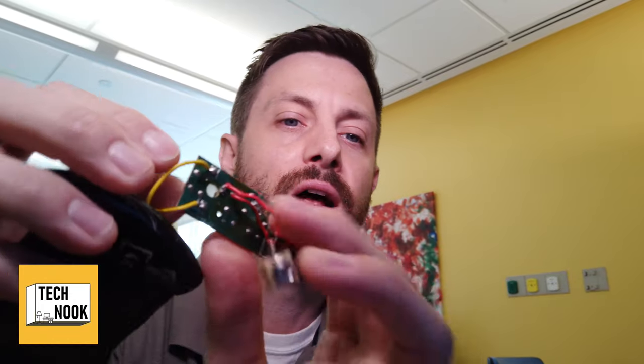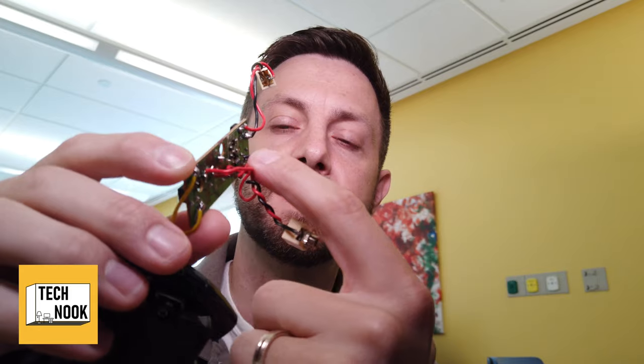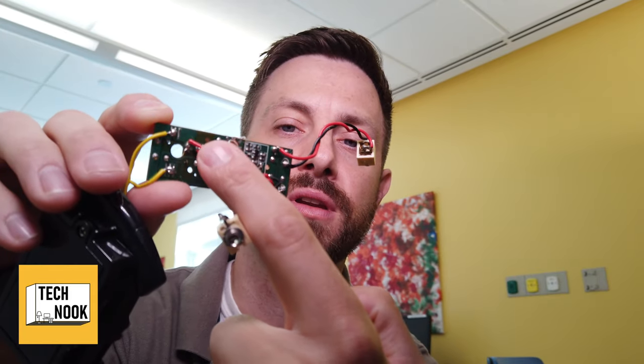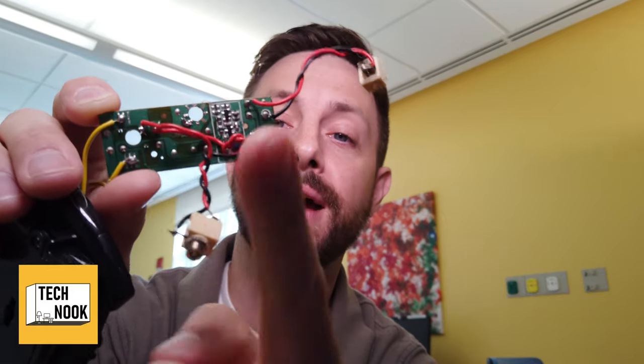So I found the one for the turn. I've connected one side of the back to one side of the turn. And then the headphone jack, one side goes to the other end of back and the other one goes to the other end of turn. So the idea is that the closed circuit is actually cutting through both the back and the turn together. That's how it adds together. It's a little complicated to describe like this, but hopefully you get my point.